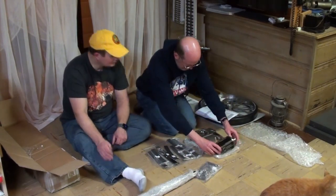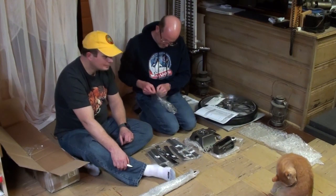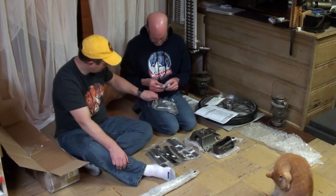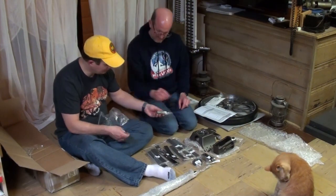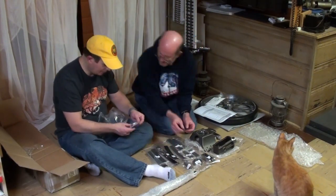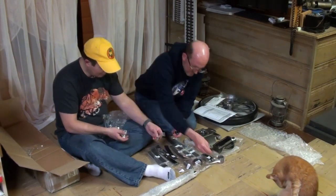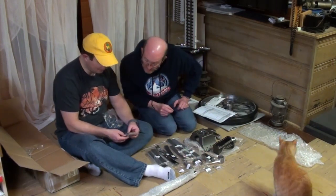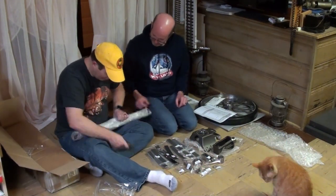In this second installment, we will be constructing the front axle and perch assembly and test fitting the front wheels. To begin, we test fit all parts prior to painting to highlight any possible issues. The first one that was discovered was the mating of the pivot to the spring hanger. Our spring hanger would not fit within the pivot casting.